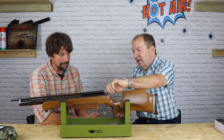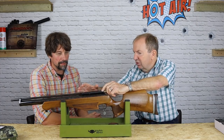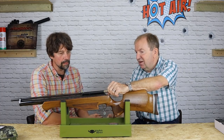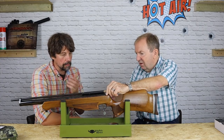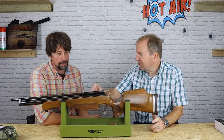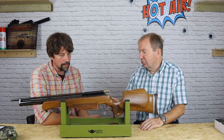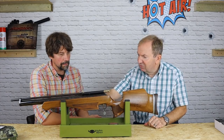What you've got here is a design study on the original Huntsman breech bolt, which was a big square block, three-eighths bolt, two-part cylinder, usually either stainless steel or brass, or some of them are steel as well. They needed to cut some money out of the cost to make them more cost-effective to sell. So they produced this rifle, which is generally nowadays known as the Mark I Huntsman. One-piece cylinder, everything stuffed inside. Only recently they stopped making guns that way — it's a little bit fiddly. When the cylinder needs testing, you need another gun. So nowadays they're done in two parts, but in these days this was done to save money.